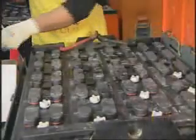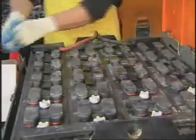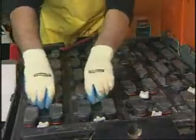With Fill Watch, watering a battery can often be less than one minute. Installation of a Fill Watch system is simple and fast. Start by removing the existing battery caps, then install Fill Watch caps aligned in the direction of the easiest passage for tubing. Cut the tubing to desired lengths from cap to cap, allowing for flexibility.